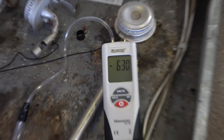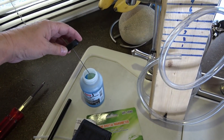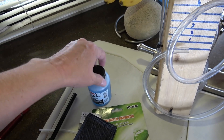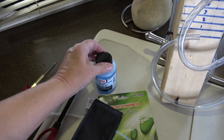If that's the case, then I'm gonna look for that small leak. I've got some of the bubble check stuff, so I'd go around and smear that on the joints and look for bubbles. If I can't smell it - sometimes if you give a good sniff you can smell a small leak. Maybe I'd send my wife Anne around looking for it because she's got an excellent sniffer.